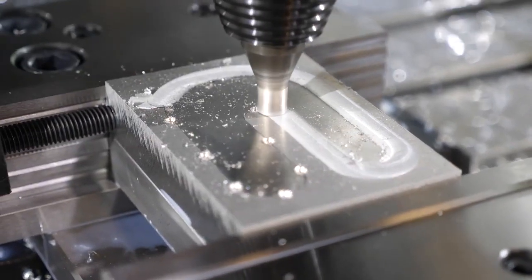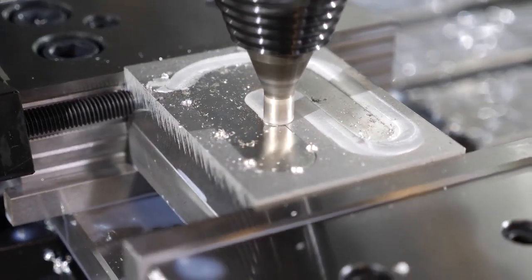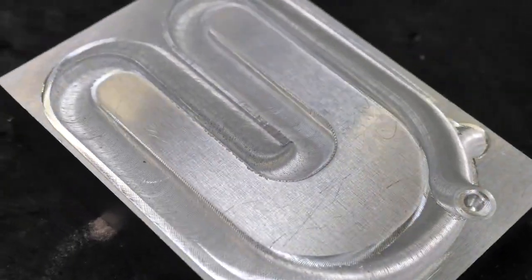In every welding process, the quality mainly depends on its temperature. Thanks to temperature measurement, if we know the right temperature for one alloy, one thickness, we can directly act on FSW parameters to reach the temperature that we want, and therefore we obtain a good weld.